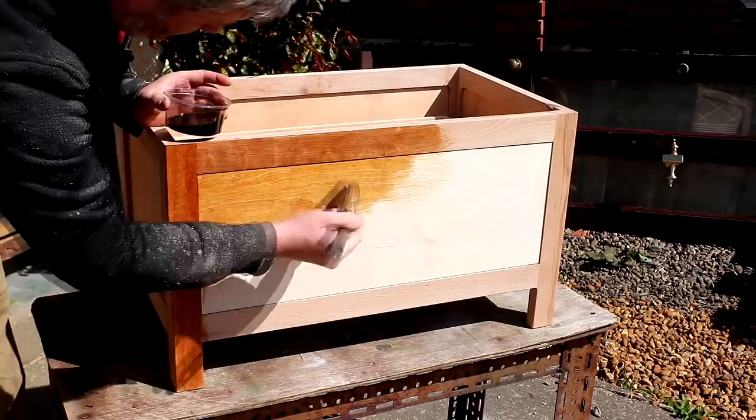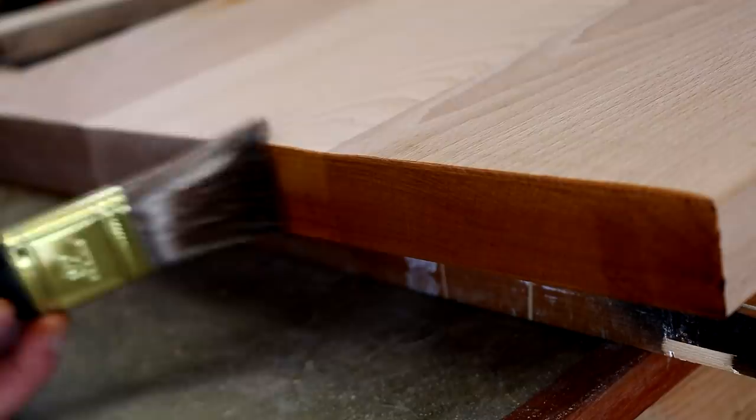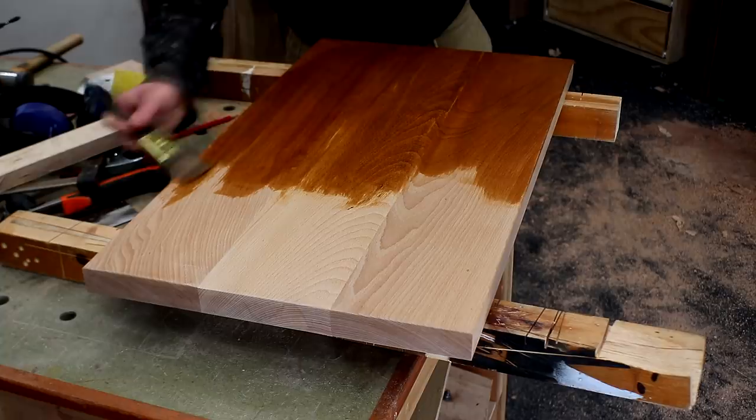So this is the one I'm going to go with, and then I'll apply a top coat of varnish after that. As I was applying the stain I really didn't like the way it looked, but as it dried out in the sun it looked much nicer and it also helped to blend the color of the birch ply to better match the beech. While applying the stain I'm trying to brush on as little as possible, and if I over-apply I wipe away any excess with a cloth because I don't want it to seep into the grain too much and turn blotchy.